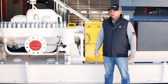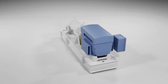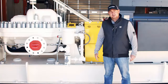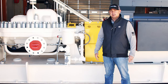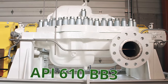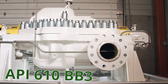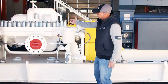We can also do hydraulic modifications in case we need to get a little further on the curve — get a little more flow or a little more pressure. Today I wanted to walk you guys through a typical crude oil pipeline pump package that we build. This is going to be heading out to Cushing, Oklahoma soon. It's a FlowServe pump — an API 610 BB3 pump, essentially a 6x8x13 multi-stage pump.